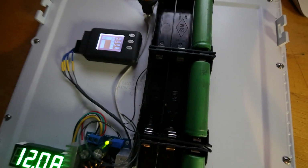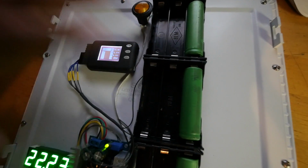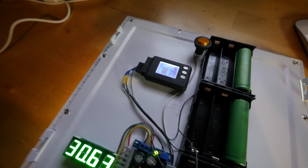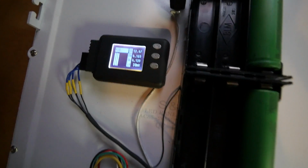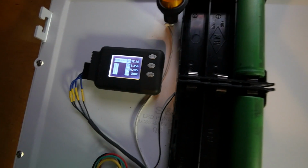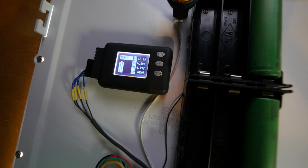The beauty about this light is that it's dimmable, and so I can show you what the batteries will do under different kinds of loads. So let's turn the light on. Light is on. It's not very bright. The cell's voltage didn't really move. But let's start increasing the load on each cell, and then you will start to see something very interesting.